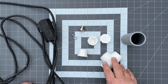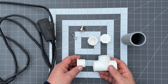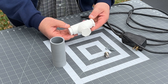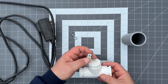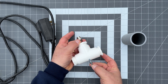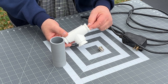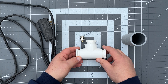Also some plumbing parts that we're going to use. Now there's 50,000 ways you can do this project, but today we're going to basically use the plumbing parts and work them just like this. We'll press these in and we'll put our SO-239 connector right on the bottom, put this eyelet on the top. This will hold our rope and then we're going to put some strain reliefs on the side to get our antenna line out of this T connector.